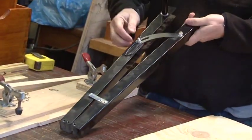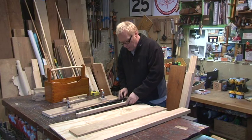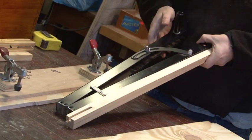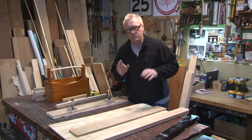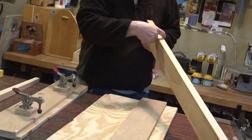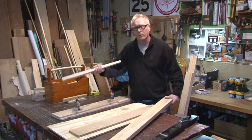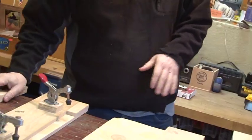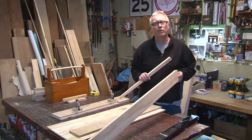In all the woodworking catalogs you can buy a commercial tapered leg jig, which basically helps you hold and cradle the leg. It's a hinge so you can create any taper you want, and it rides against the fence on the table saw. We're going to build our own, specific for this project. I'm using off-the-shelf dimension lumber, an inch and an eighth thick. Our legs taper down to three-quarters of an inch, and you can get all four legs out of one piece of wood — cost me a couple of bucks at the home center.